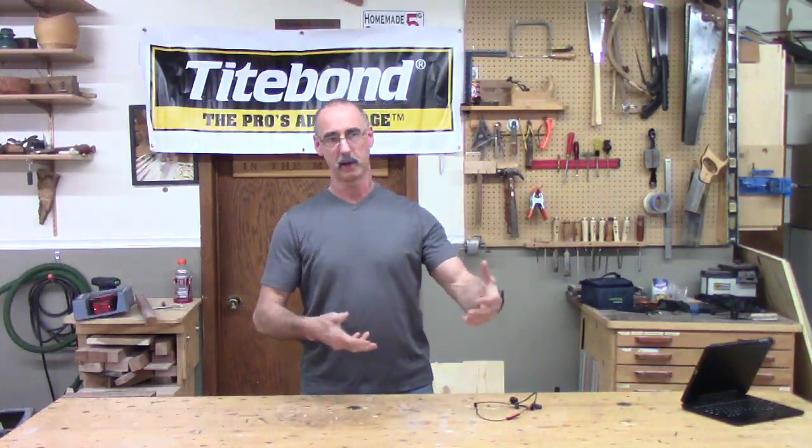Do I finish the trunk first? I probably would. In general, it's a good idea that whatever you're doing to one face of a board, you should do to the other. So build the whole trunk, finish the inside, then start lining it with cedar closet lining or whatever you're using. Take the cedar all the way to the top? I don't know. There's an aesthetic there more than a right or wrong.